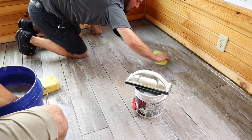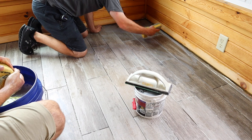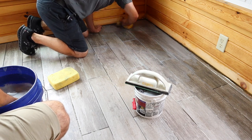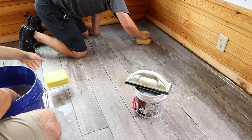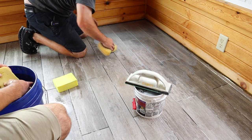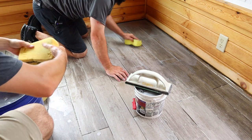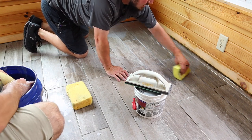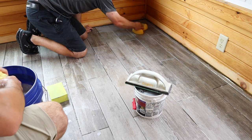We're coming better and better each time. The further you get along with it, the fewer passes you're going to do with the sponge. Jordan is just wringing it out so there's very little water left. You basically keep going back and forth until you're not spreading the grout around anymore. You don't have to be an expert to do this — it doesn't take a PhD. You can use different sides of the sponge to make sure you get everything.